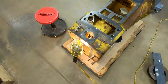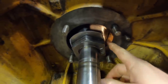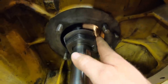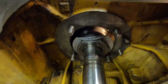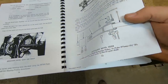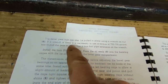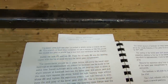I've removed the holding tools, pulled this bearing cap off again, and slid the entire bevel gear and shaft out to get at the fold-over lock. What you want to do is utilize the raised portion of the hub right above the keyway slot to fold the lock onto, taking advantage of that square shoulder — that ensures no counterclockwise rotation can happen at all. 180 degrees off I utilized one of the flats on the nut and folded the lock down tight. If you didn't have the fancy pressing tools, the manual also says the bevel gear hub can be pulled in place using a wrench on the nut — 700 to 750 pound-feet using a four-foot pipe extension.